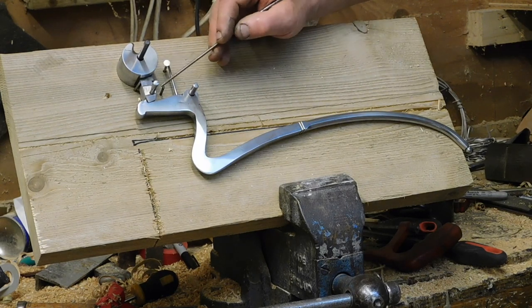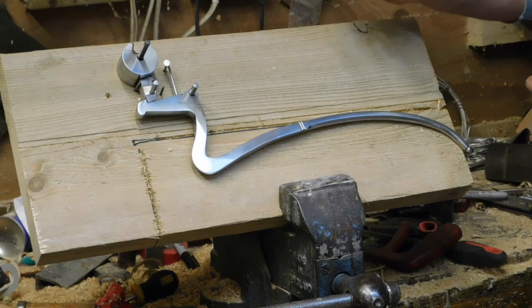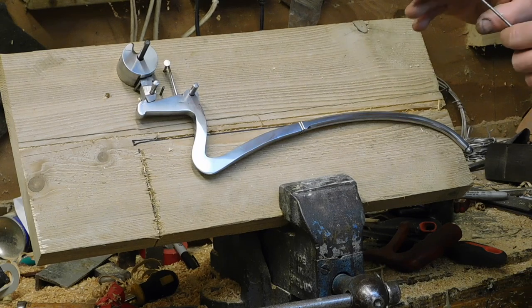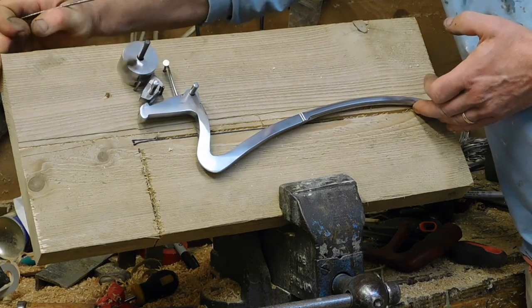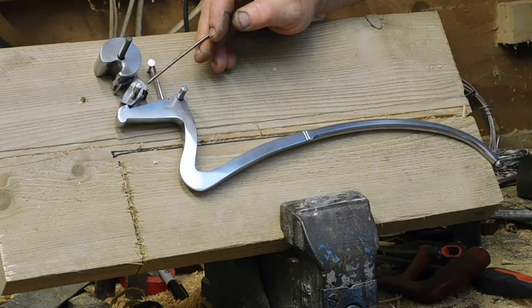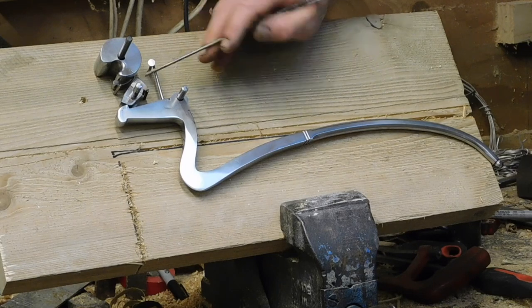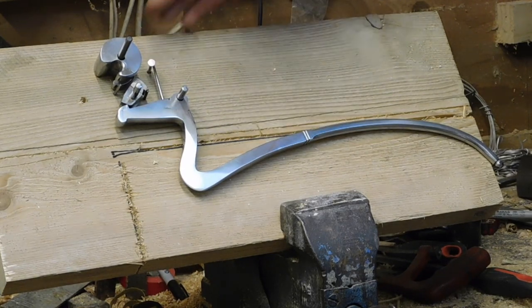There are two pins that control the rotation of the sear. The reason you want the sear controlled is that once you've shot the system, the sear is not spring-loaded — it doesn't return itself. So it becomes trapped within the stock and you can't access it to put it back into the right place.